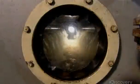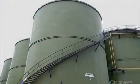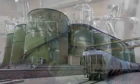This one, a 70-minute wash with a solvent. This chemical extraction process removes all but a trace of oil. The factory then grinds the cake into protein-rich meal, which it sells as animal feed. The extracted oil, stored in large tanks, now enters the refining phase.